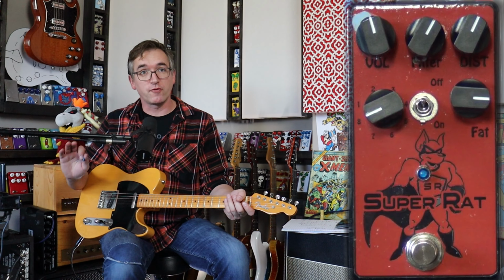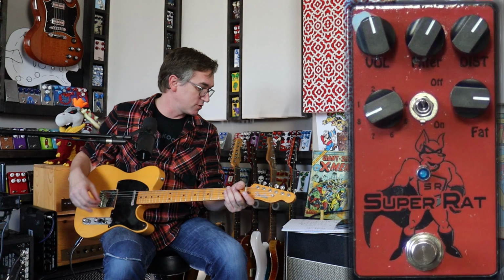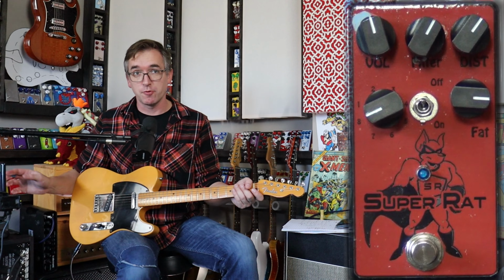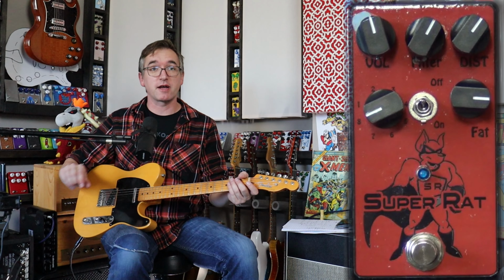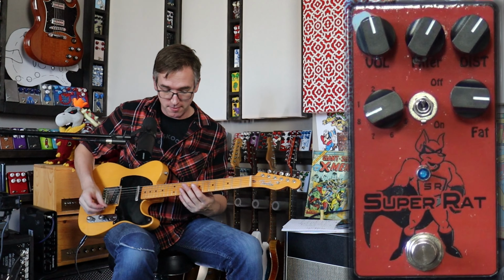What I'm going to do is give you my Foo Fighters kind of rock guitar sound, right? So I'm going to use a Telecaster with a single coil to get a little bridge thing going. But with this, we are on clipping 8. There's no diodes in the feedback loop, and there's no hard clipping to ground. So this is just ratty IC chip blowing up kind of thing.